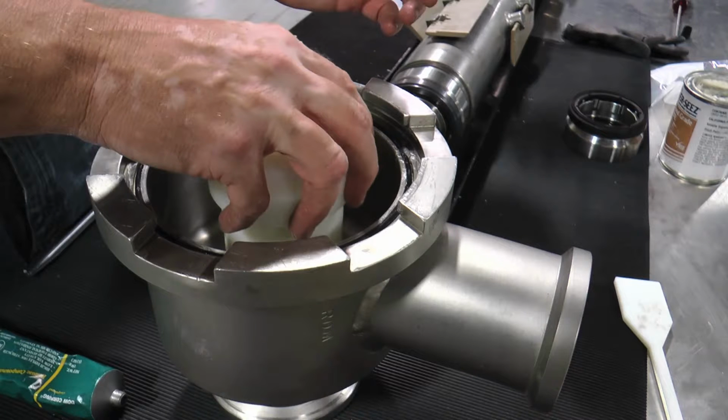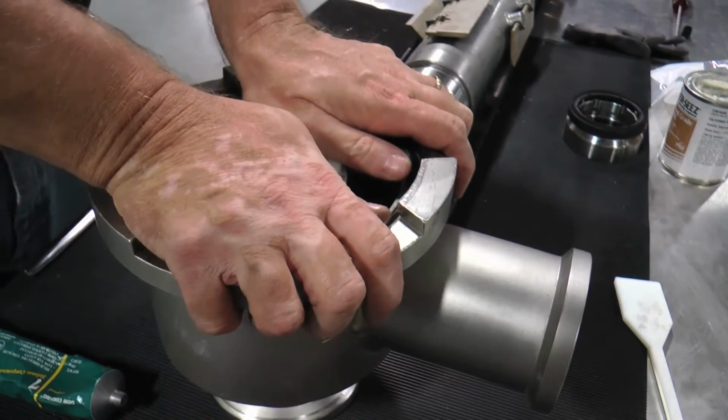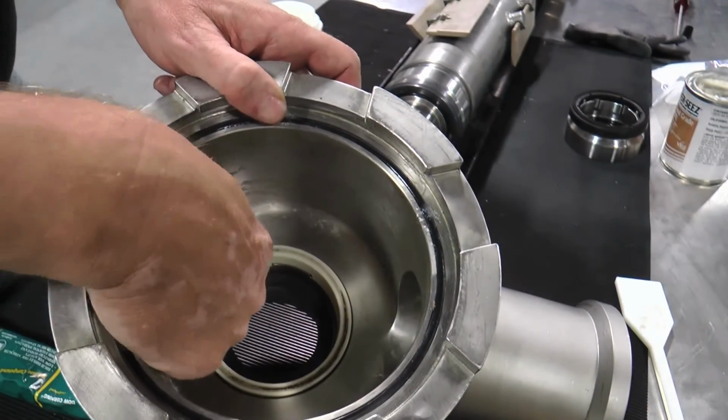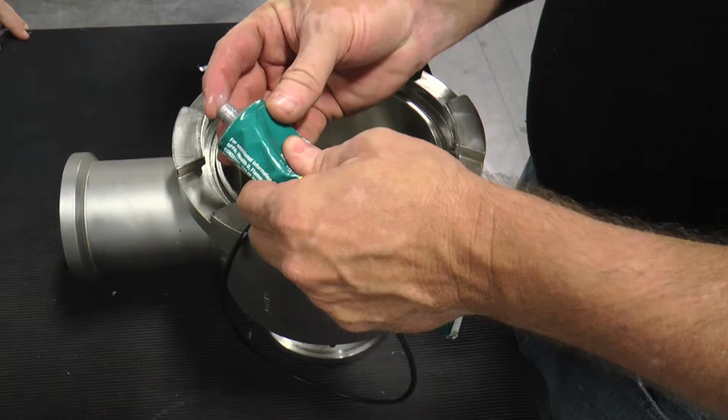Insert the small diameter end of the seal installation and removal tool onto the double mechanical seal ring with the paddle in the groove and push firmly into position. This maintenance activity is the same procedure for both the drive and non-drive end heads.